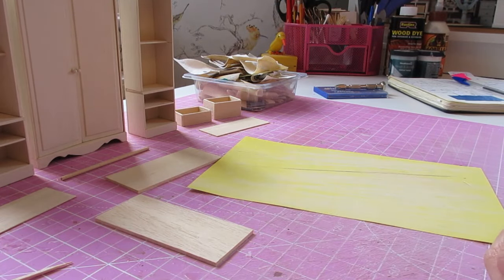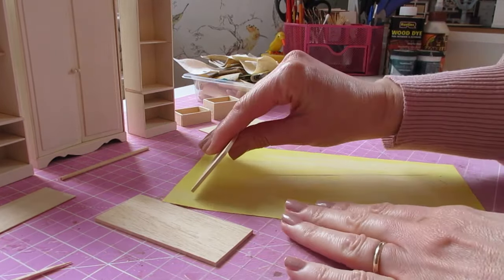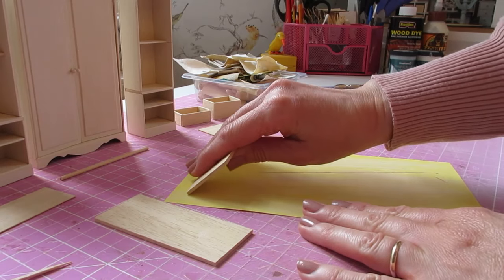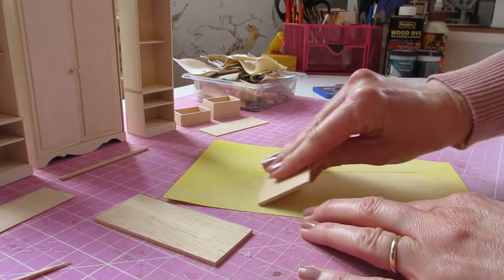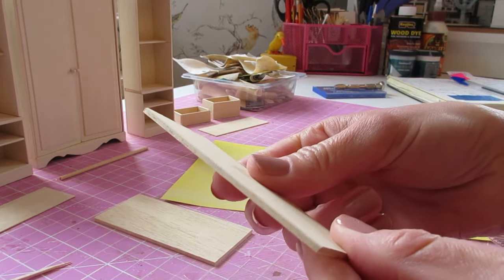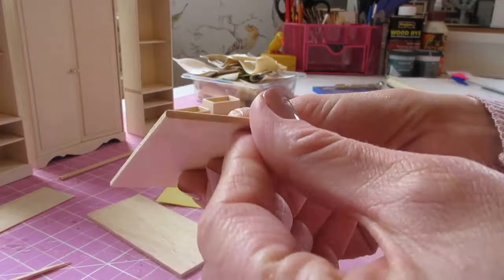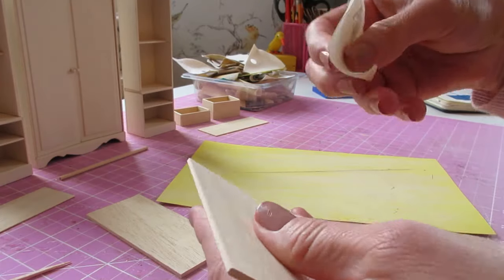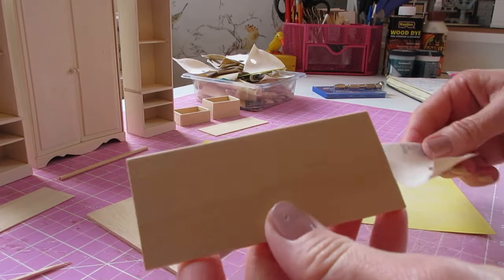Push the drawers to one side to dry. We're going to round off one long edge of each door. With your sandpaper flat on your work surface, hold the piece at a 45-degree angle and as you sweep it towards you bring it into an upright position. Five sweeps is usually enough to get that nice gently rounded edge. Do that on the underside of the piece as well, then sand it in your hand using 500 grade sandpaper just to tidy up the edge.